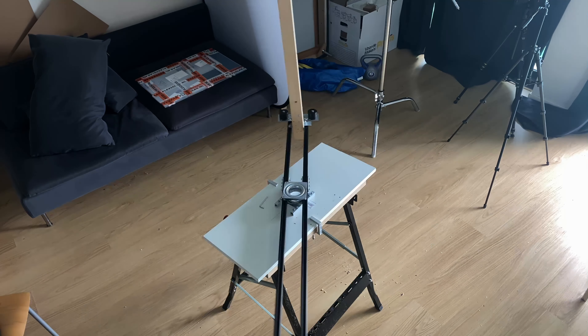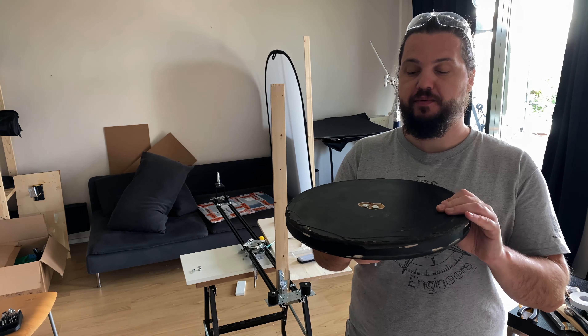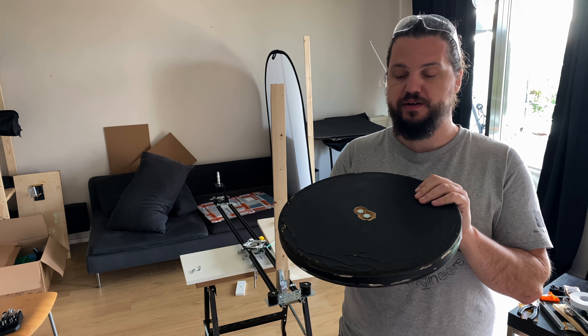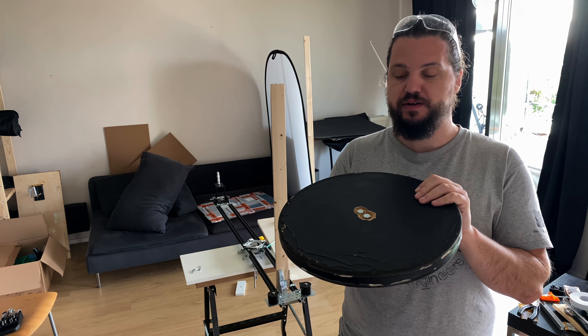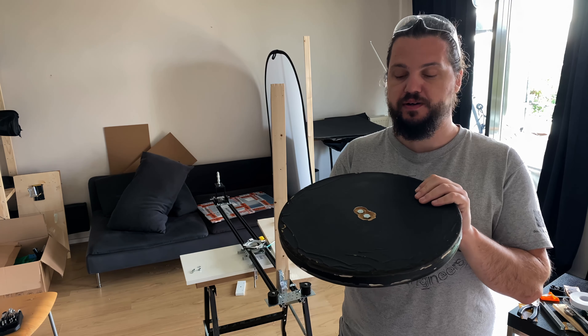On the camera side, I want it to be able to move freely up and down the extrusion frames, so I'm using some sort of quick-release bolt nut. In my first version, I use a piece of wood that I screwed to the frame, on top of which I'm adding a tripod head to secure my camera. Weight distribution is vital — when one side is heavier than the other, it will create friction on the bearings of the Lazy Susan. With uneven weight distribution, the rig doesn't even turn once. However, when distributing the weight correctly, it will spin on and on.